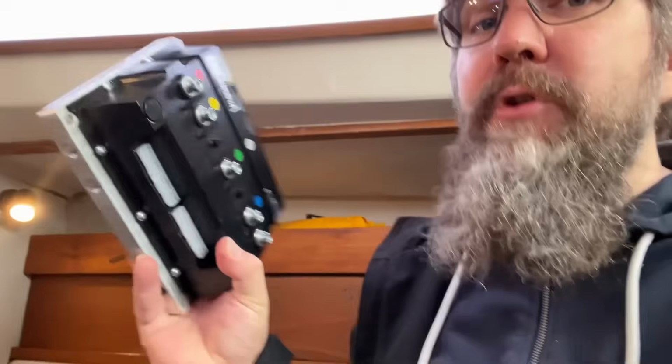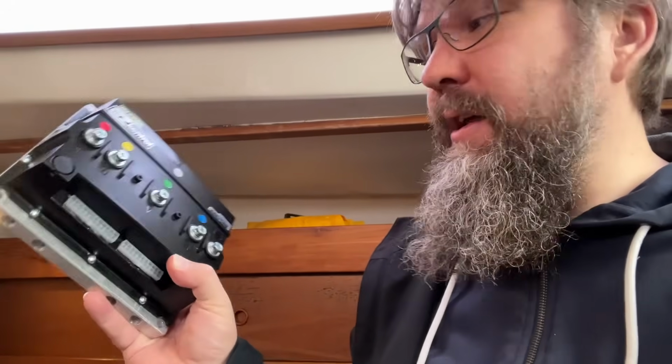Those sensors are essential when you're rotating the motor very slowly and you need high torque, for example in a car, motorcycle, or something like that. In the case of a boat, we have the propeller in the water, and initially when you start rotating the propeller, there is really not any kind of resistance at all at first. So in this case, using these motors without sensors should work, but as mentioned, I don't know if this works. And this is the first step.